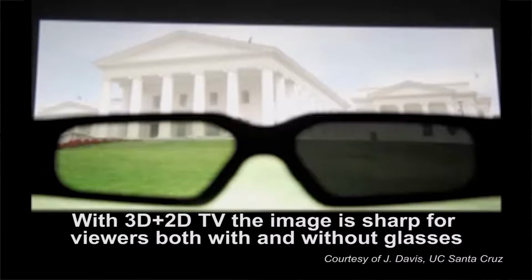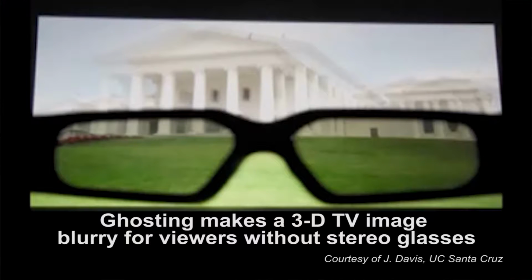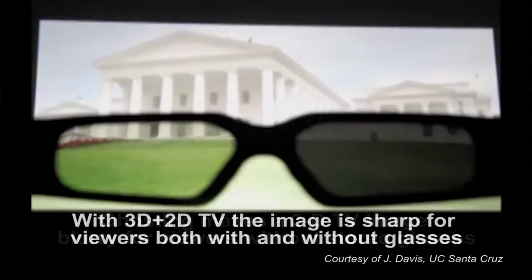2D viewers see a low contrast image because the prototype makes the darkest pixel relatively bright. To restore acceptable contrast to non-glasses wearing viewers, the investigators enabled the images seen by the left and right eyes of the glasses wearers to have unequal brightness, where the left becomes brighter and the right dimmer. Experiments were conducted to determine the optimal brightness ratio between the left and the right images.